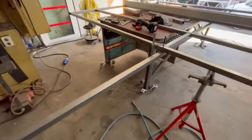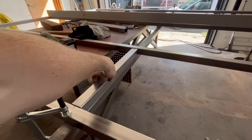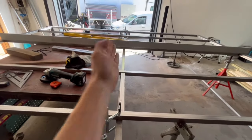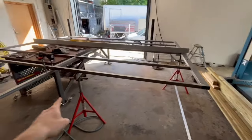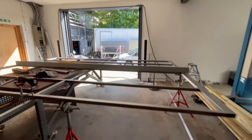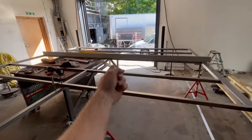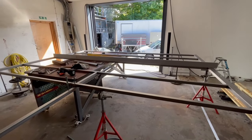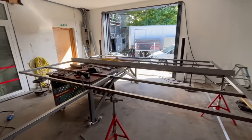And now I put up this support on a straight line here, in the center, to have those on top of when I'm going to weld them, so then I'm going to have a straight line, so it's not going to be like this all the way down. And also, since my table is a little bit too small for this door and I only have those feet supports around, it's quickly that the steel is hanging like you see in the middle here. That's why I put this straight bar on top, so this now I have to make a little bit up when I weld it, so the door is not hanging when I weld the center piece, because then it's going to be like a banana. So this is actually a lot of work, but I think we're going to manage it pretty good now when I do like this.